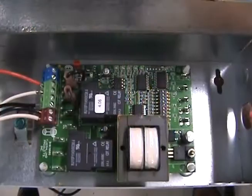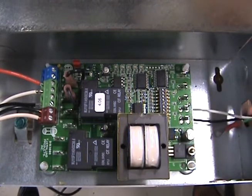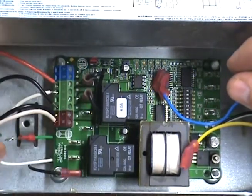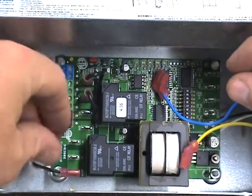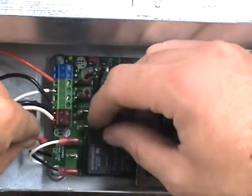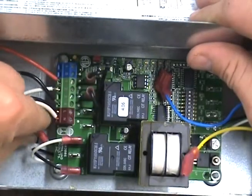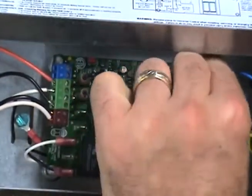If not previously completed, you also need to attach and wire the UC-1 whip to the circuit board and to the venter. Carefully slide the black, white, blue, yellow, and green wires — four of which have female spade connectors — into the UC-1 cabinet. Attach the black to the MTR terminal and the white to the N terminal. The blue and yellow will connect to P1 and P2 and are not polarity sensitive. The green wire will attach to the box grounding screw.